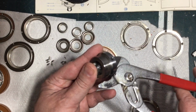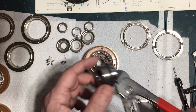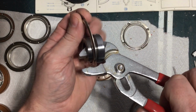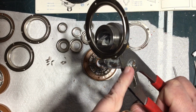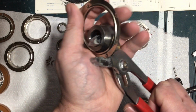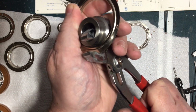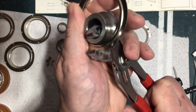So the way you would do this is with a pair of channel locks, and again, just another junk bushing thing that I had. You could use a socket, a piece of pipe, anything round that'll fit over here. You put that ring in the channel locks like this, hold it square to it, and remember where you start, you can mark it. Just very gently squeeze and turn, squeeze and turn, and you're not doing much. You just barely see it squeeze in. And you go all the way around,